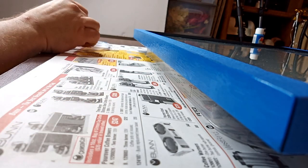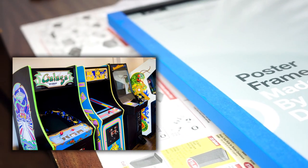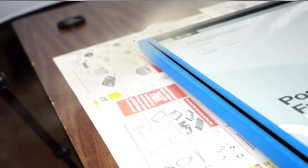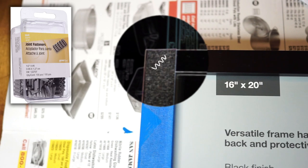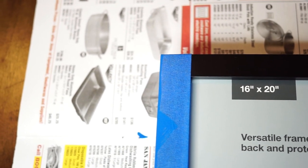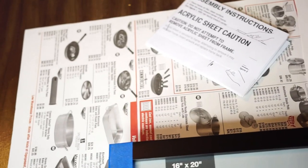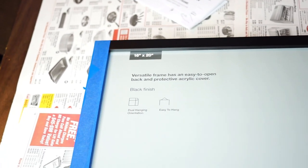While we wait for this to dry, let's talk about the T-molding. Brightly colored T-molding contributes a lot to the attractive aesthetic of many of these classic arcade games. I have my router, and I could use it to try to carve the necessary T-molding channels into my frame. I'm not going to do that for a couple of reasons. I don't know if there's joint hardware in the corners of this frame — that would be directly in the cutting path and would be a problem. I also don't know if this wood is sturdy enough to stand up to the stress of being cut with a router. Since this frame seems to be made of thin slats of MDF, I could easily see much of it chipping off, especially around the corners. And at my skill level, I just can't envision a way to run a router down this fully assembled yet slightly flimsy frame safely.